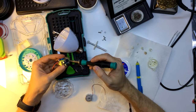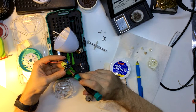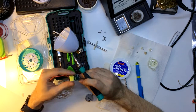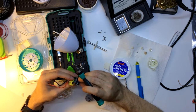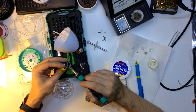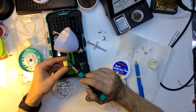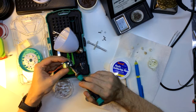And then through the inductor, or the inductor, good lord, Chris, use the right terminology here. Through the bridge rectifier here, that's coming out of that side, just inside the board there. One side of, let's see, the negative side of the bridge rectifier is coming into... I think it's this capacitor. That would make sense, because conventional current flow, that's where the electrons are coming from. So it's coming into that capacitor, which goes over into this inductor. And that, I know for sure that's an inductor, because it's big and lumpy and seafoam green. And that's a 4700 microhenry inductor.